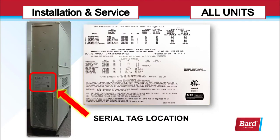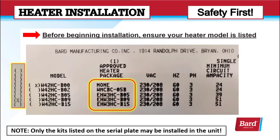This picture just shows you where you're going to find the serial tag location on a BARD wall mount unit. Before beginning installation, ensure your heater model is listed. Now here we've got an approved heater package, and you can see the model number on the left. This is a W42HC, and then it lists out the heater packages that are allowed to be installed there.